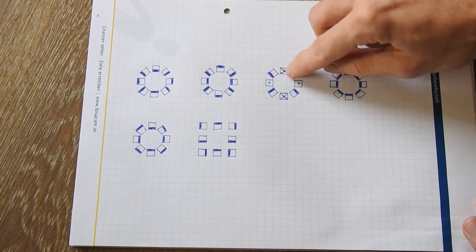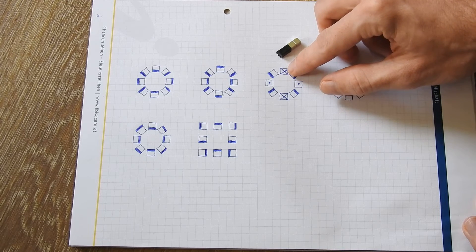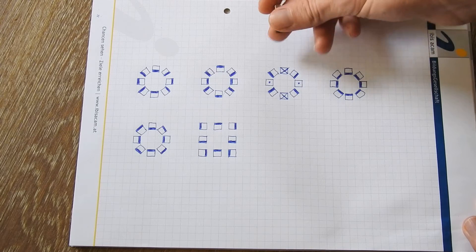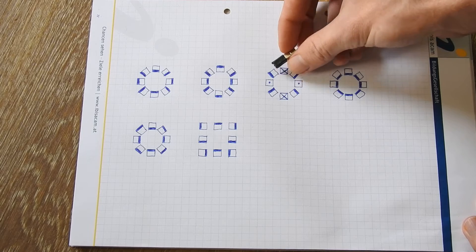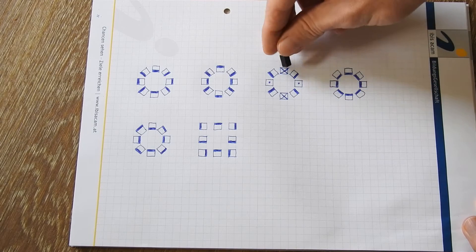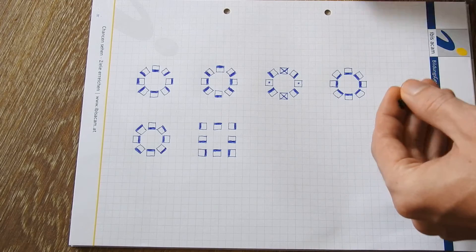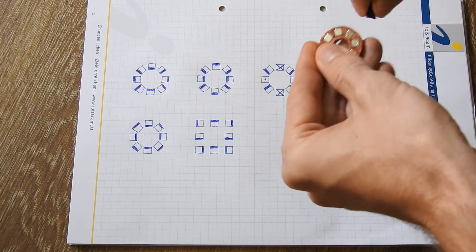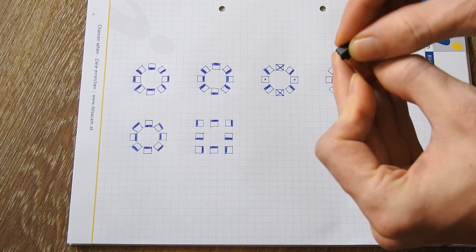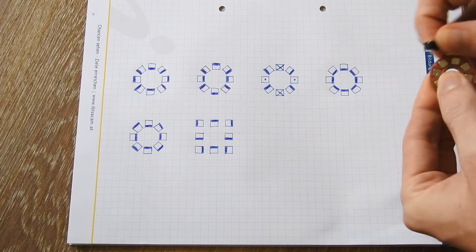For this array, we also start with the same base magnet. I have the next magnet marked with an X and the other with a dot, indicating north or south pole viewed from the top. You start arranging it, then rotate 90 degrees in this direction, come over to the next position, rotate it again. You always rotate 90 degrees in that direction for each new position in this arrangement.